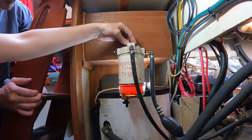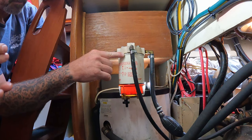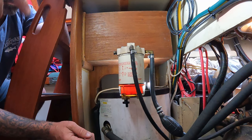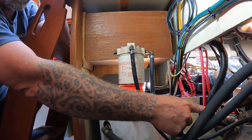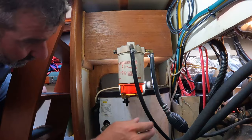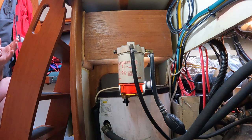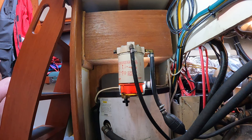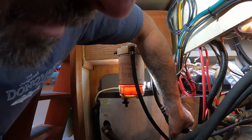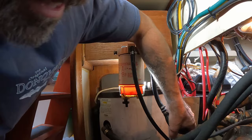Crank it, I'll pump. Okay, ready, go ahead. Instead of pumping it I was keeping continuous pressure on the prime ball - and I wasn't losing any pressure from it. So there's no sign that any more air is being sucked in. All right, we're going to get this. I'm starting to finally get a little bit of pressure. Give me another ten seconds. The starter wires are fine down there, there's no heat at all. I'm more worried about the batteries because they're so close to dying.